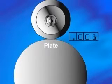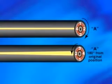if you set a roller on the low side and it was out of concentricity by as little as 3/1000ths, you would be squeezing the high side 9/1000ths. This condition is the cause of deflection. You cannot hope to set this defective roller correctly if, with each quarter turn of the roller, the stripe size varies anywhere from 1/16 of an inch to 1/8 of an inch.